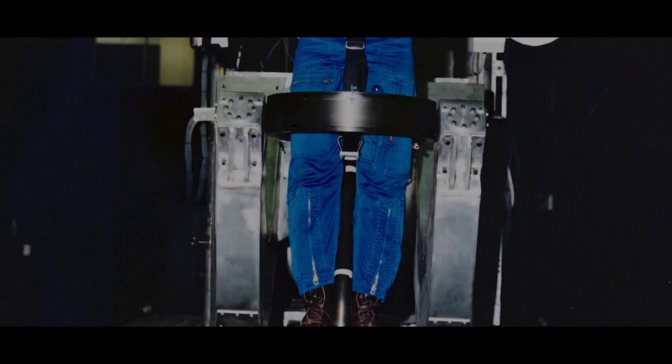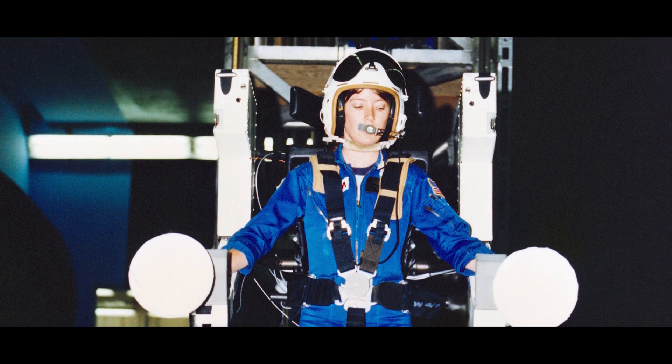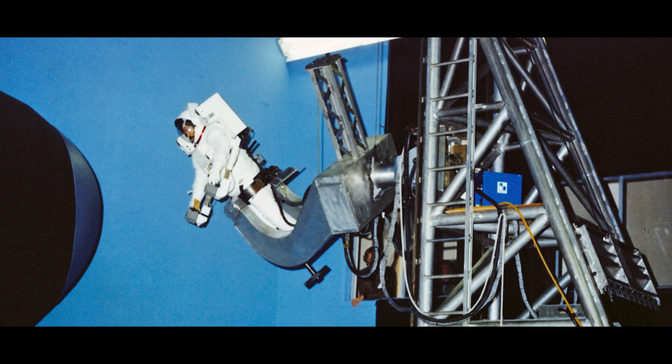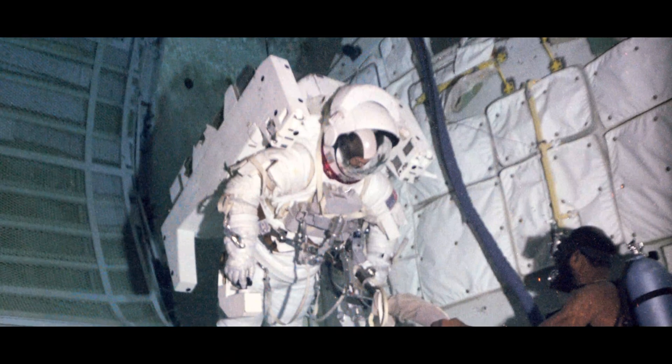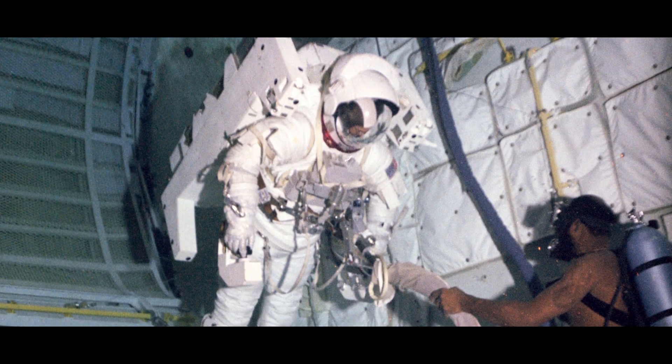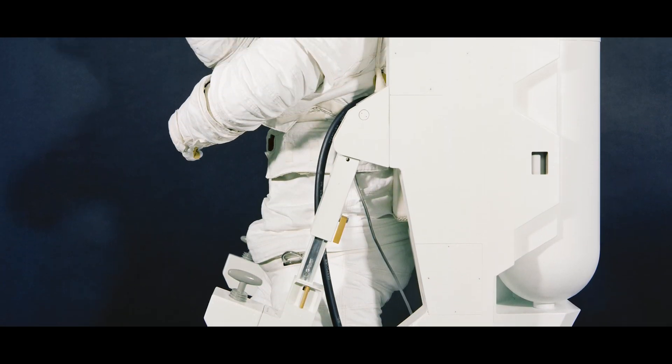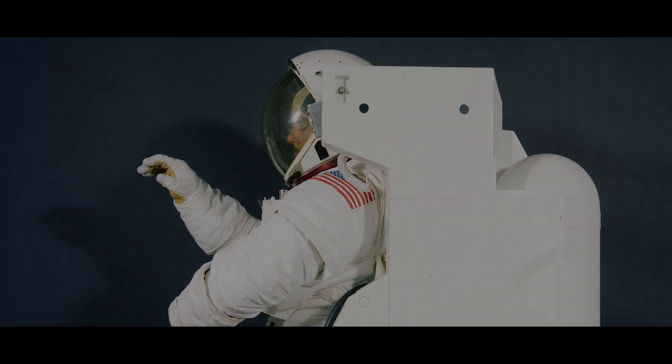This is an experimental test pilot's dream. When you're evaluating an airplane — either as a test pilot on an airplane or helicopter, or the MMU — you try to envision missions that this thing would do. Then you try to see how you would go about doing that mission, and whether you had any difficulty doing it. That way you give it a handling quality rating, which ranges from 1 to 10: 10 being loss of control, 1 being you can't get any better than this.